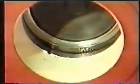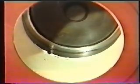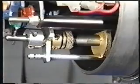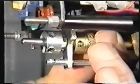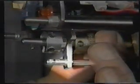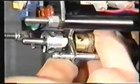First, we'll set the limit for valve closed. Turn the actuator hand wheel manually until the valve is closed. Close it firmly. Turning the screwed shaft anti-clockwise, bring the traveling nut, this is it here, hard up against its backstop. Gripping the screwed shaft between your thumb and forefinger, continue to turn it, using this over-travel guide for leverage if you need to. Bring the over-travel guide up to the overrun stop.